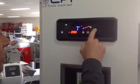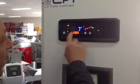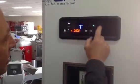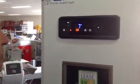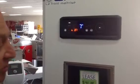So we go into that program, we press 1. Tomorrow is Tuesday, and we'll go over to Tuesday. We press OK. Now we can change the hour. Let's start at, say, 7 o'clock. We want to come into bake, we want the ovens on ready to go, and we want the proving. So it's 7 o'clock, we press OK. We're happy with 7 o'clock for the minutes, so we press OK.